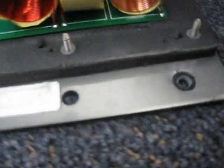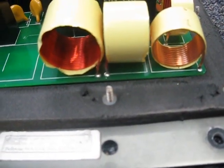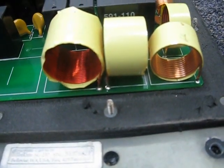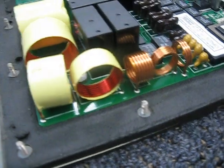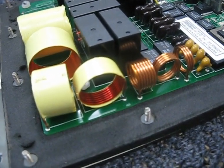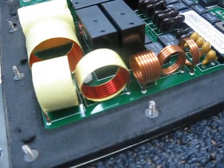You just don't have components of that size just floating on two little legs. I come from a marine electronics background, and fishing boats and boats in general are a harsh environment for electronics. Whenever you've got large components you just make sure they're not going to jump around — no vibration, no stress on the component leads.